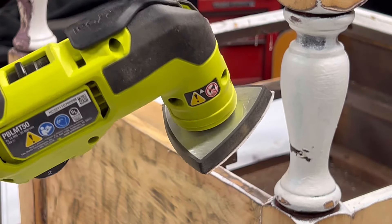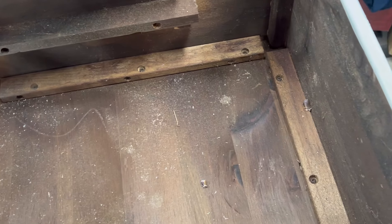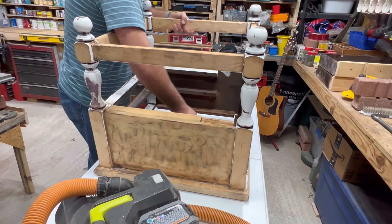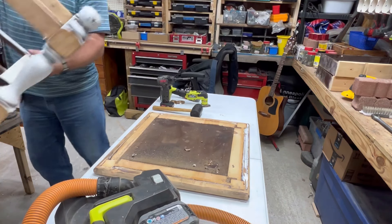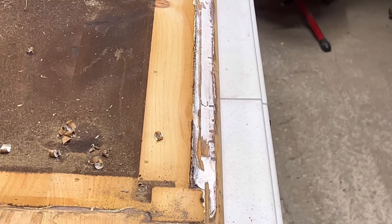The oscillating tool is working fine but I just realized — why am I not taking this piece apart so it's easier to reach these spaces? Sometimes I'm dumb. So we got our screws out, and of course the heads are rusty — might as well just put them in the Evapo-Rust with the other stuff; they'll be clean in no time. Disassembly complete — should be a lot easier to get to all of this area now. I could even use a random orbit sander if I wanted to.